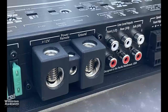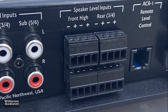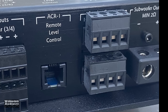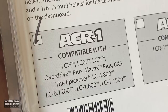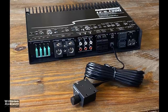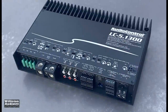There are 10 inputs — the manual says you can use 1/0 or 4-gauge wire; I would go 1/0 to give you all that extra current you may need. As far as RCAs go, there are six different RCA ends, and you can switch to just two ends if needed. There are eight inputs for high-level speaker inputs, which sums all the different frequencies together if you have many different signals coming in. There's also an ACR1 remote level control — this is a separate option and not included. The four-channel mode speaker outputs are 12-gauge and the subwoofer channel has 8-gauge wire.